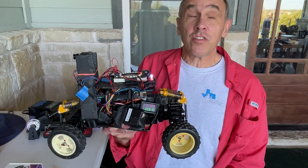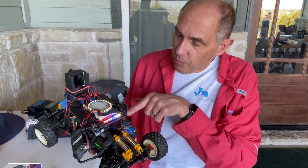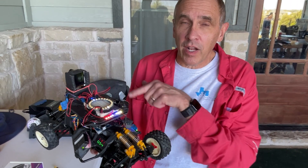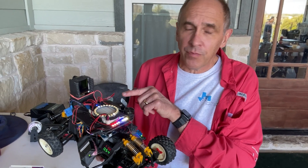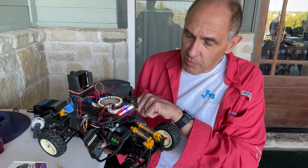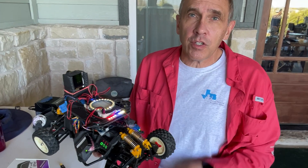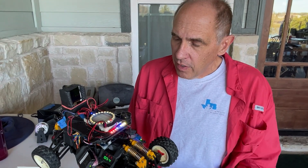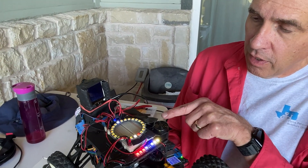The algorithm and software are working well. Since last year I noticed the serial port was susceptible to single-bit errors when I last ran this two years ago, so I refactored it so that multiple bits have to be wrong to false-trigger. I also replaced the Arduino soft servo library with a PWM library so it uses hardware timing now — no more interrupt conflicts that were corrupting serial transfers.